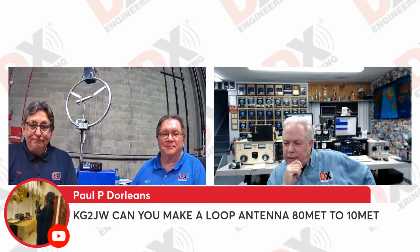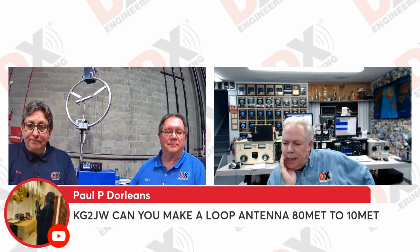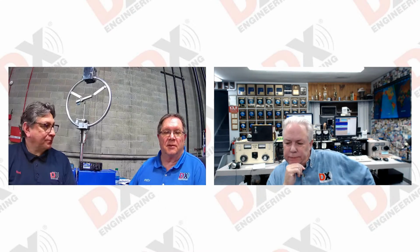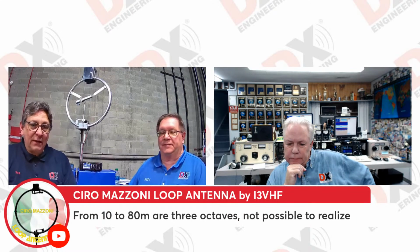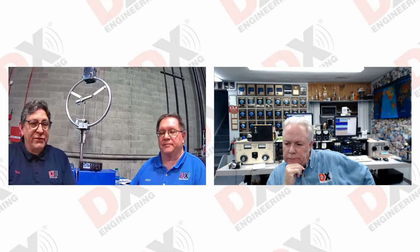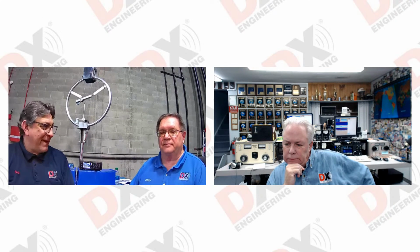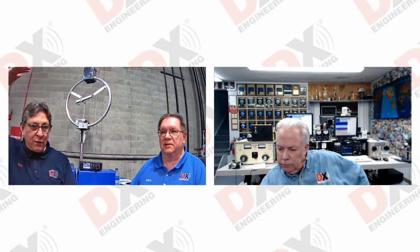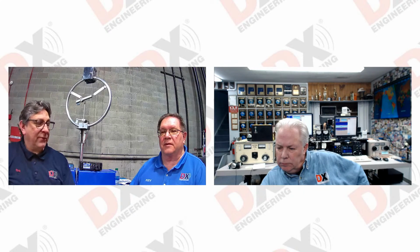Okay. And so Echo Alpha 3 Echo Alpha Juliet asks, how does the antenna work on the railing of a balcony with other floors above? That's a tough spot because in that situation, the loop might be too close to the metal of the railing, and the capacitor at the top might be too close to a rebar and cement ceiling above. So there are some situations where that can work, and there are some that it cannot.